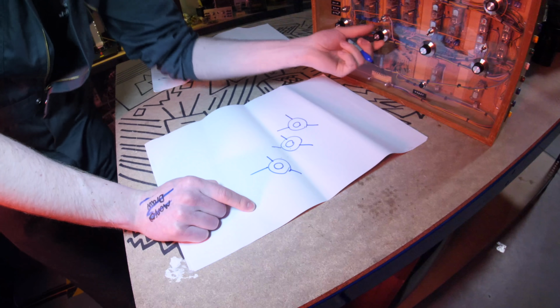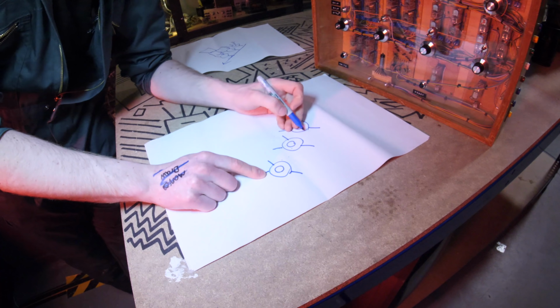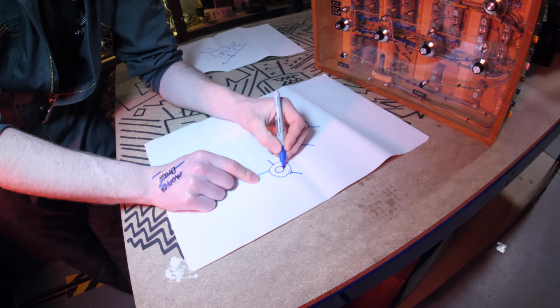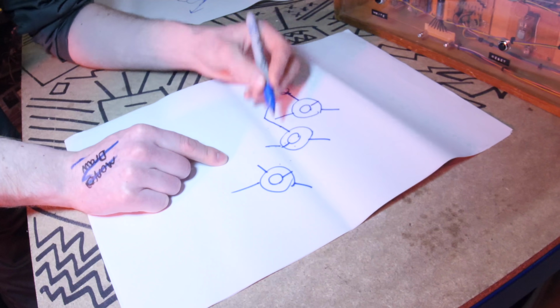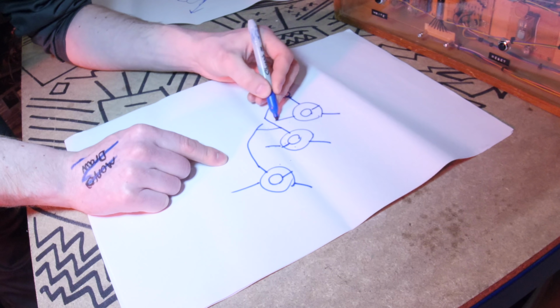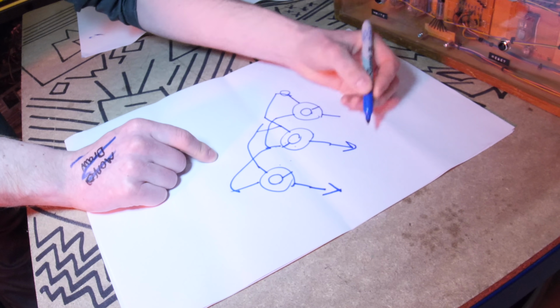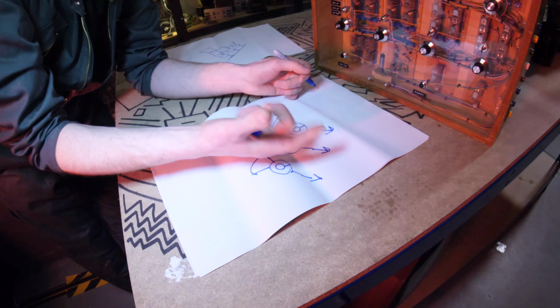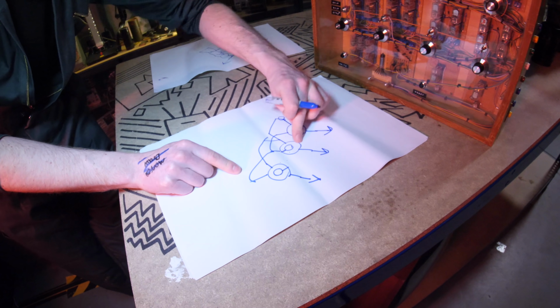and this goes to the output. With this relay sequencer, however, the potentiometers are wired slightly differently. These are the potentiometers, the knobs that we're twisting. This is leg 1 of the potentiometer, leg 2, which is the middle leg, and leg 3. These are all connected together, and then these are all connected together, and then these go off to the relays and turn on to the outputs. So you can select the knob anywhere between this side, and it sort of acts like a crossfader.